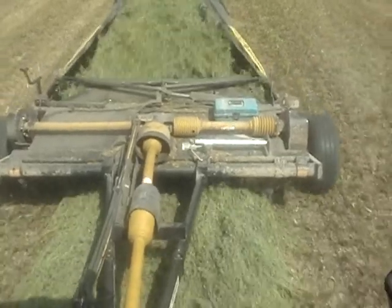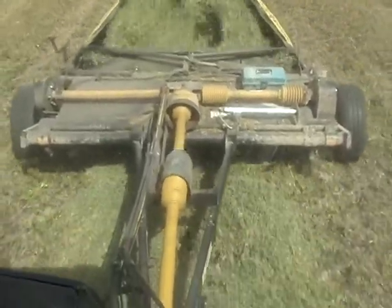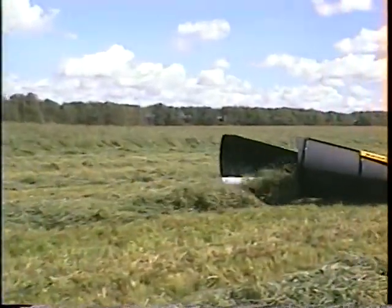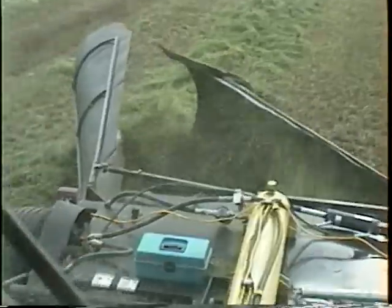With the high-speed movement of the hay coming off the rolls, the plastic deflectors can do several different jobs. In straight conditioning, they protect the swath from blowing while it's in the air. Give them a small shift, and they can move the swath a few feet sideways to dry ground. With a bit more deflection, you have a high-speed swath inverter that doesn't create lumps or wads in the windrow. If your cut is 12 feet or less, the deflectors can be used to lay 2 windrows side by side to feed a large baler.